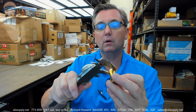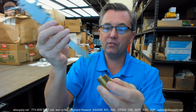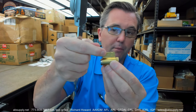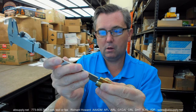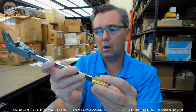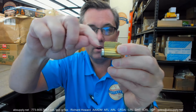Now let's take a couple of basic dimensional properties on the cylinder. I get asked questions like what's the size of so and so. The diameter of the plug is 0.56. The projection of the plug from the face of the Bible — and that is what this is called, literally it's called the Bible — is 0.151.